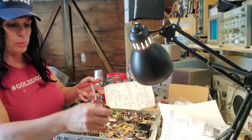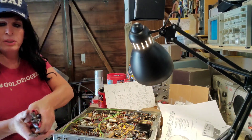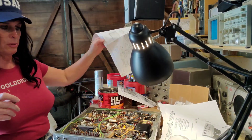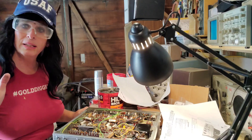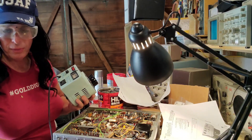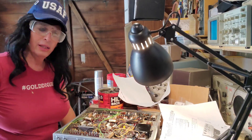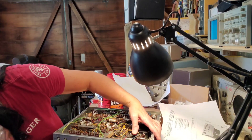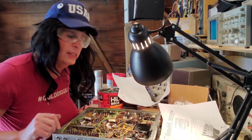We're going to need to replace the fuse too, because that obviously got taken out in the whole melee. And we have to make very sure — this probably saved my eyesight last time — to have eye protection. I'm going to use the Variac to slowly bring it up to operating voltage so I'll be able to see if anything smokes and turn it off real quick before any damage can be done. Kind of liking the look of that — everything's tucked in pretty neatly, so on with the show.